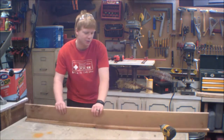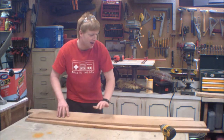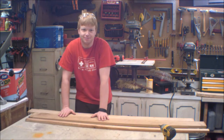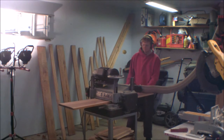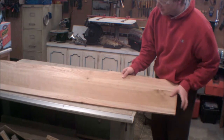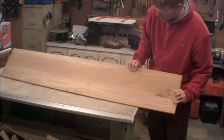I have a lot of reclaimed lumber building up in my shop, so I'm going to glue some of these thinner boards together to make my blanks. Because it's reclaimed wood, I have holes on the edge that I'm going to hide by burying them in the glue joint. After the glue dried, I planed the boards to final thickness. This is where a 15-inch planer really comes in handy. All the glue squeeze-out gets planed off as well. A few passes on the planer and these boards don't look too bad — definitely project worthy.